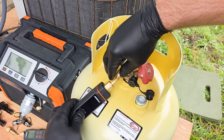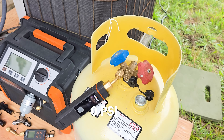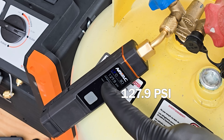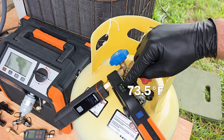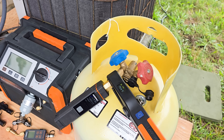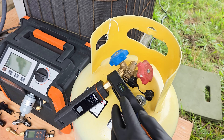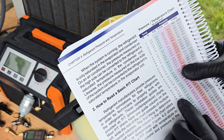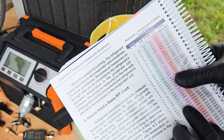We're going to screw this on right here. This is already turned on so we're at zero PSI. We're going to open up the tank and you can see we're measuring 127.9 PSI and we're reading 73.5 degrees. This recovery tank has been outside for about an hour and it was in the service truck before that. It's morning time so the temperature shouldn't have changed too much — it was around 70 for a while, now it's 73. We can look on our PT chart for 127.9 PSI.